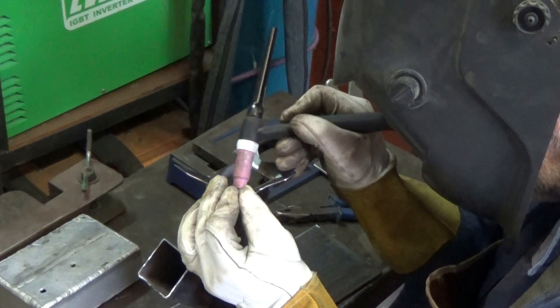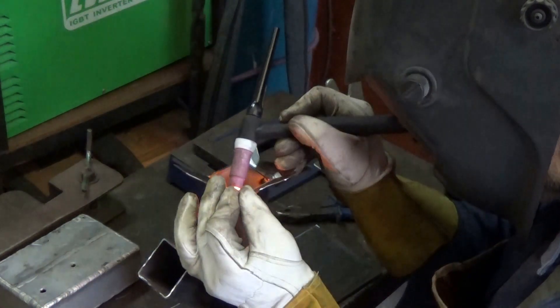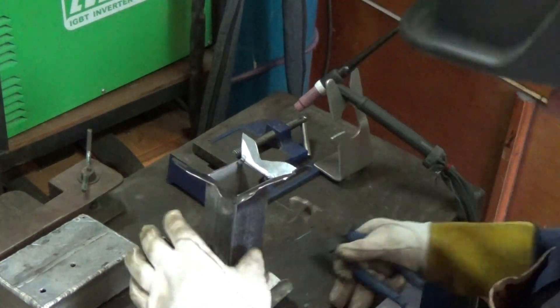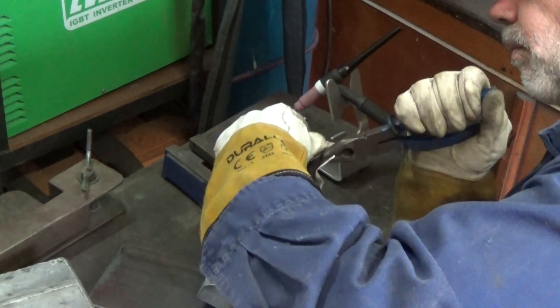Because I want some air flow between the pan or billy that I'm going to be putting on top of this, I'm just welding some little pieces of steel with some cut-outs in it to make it a little bit wider so it's easier to put a frying pan on, but also to let the air flow.